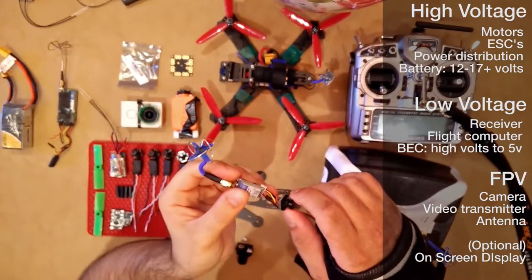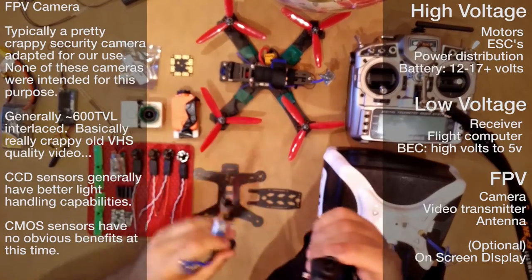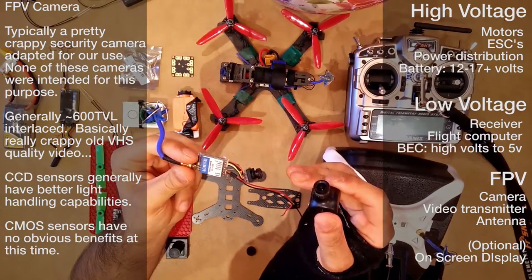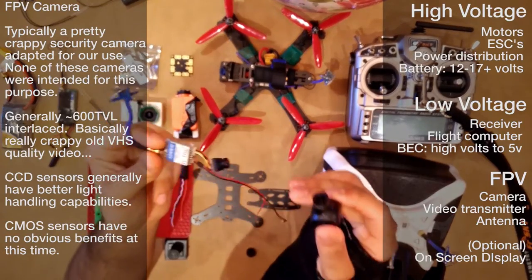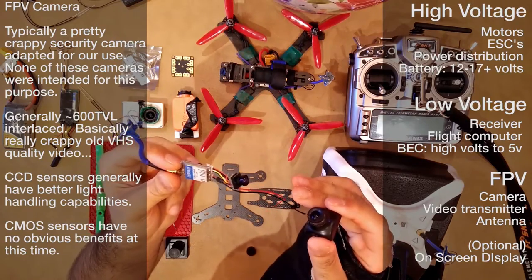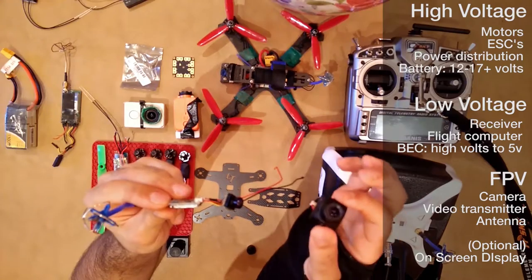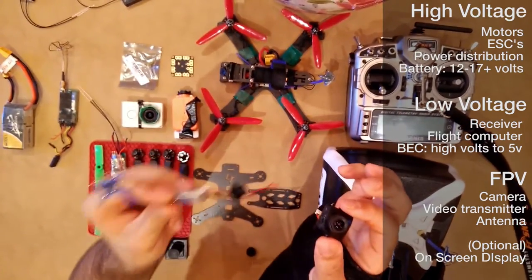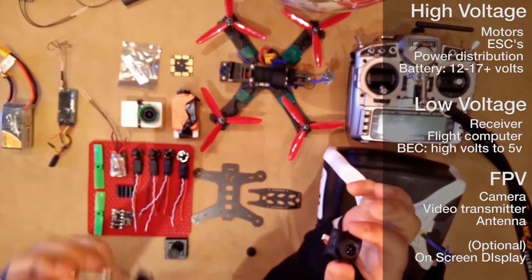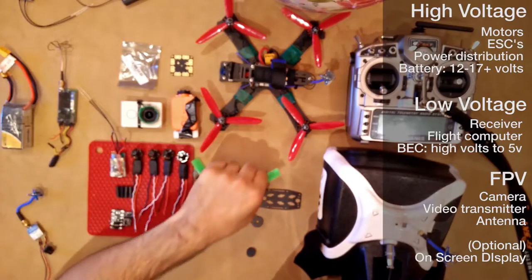This is a really small camera. The difference between these two cameras is that one has a very small CMOS sensor, and this larger camera has a better CCD sensor. In an SLR context, CMOS is a good sensor, but in this world these sensors are developed for low-quality security footage. What we're actually getting out of these is about 600 TV lines, interlaced. The benefit of the CCD is that it responds better to light and you typically get a better image than from this really low-quality CMOS. The reason I'm not going to be using this frame is because it will not actually accept a camera this large — between the props, the camera physically does not fit.